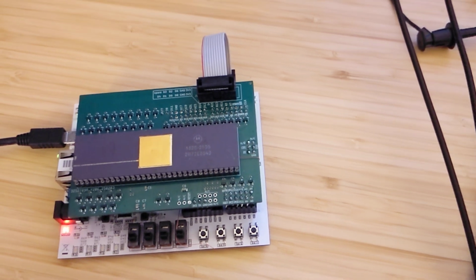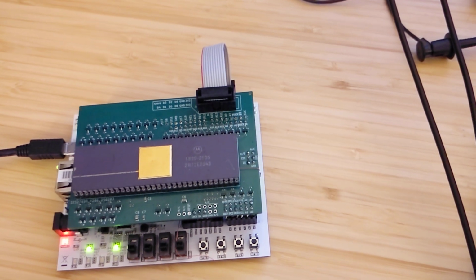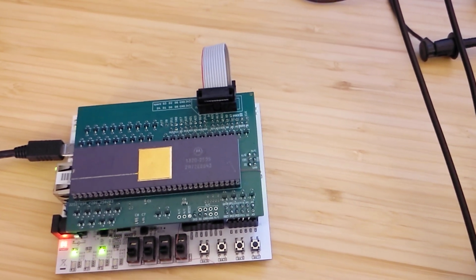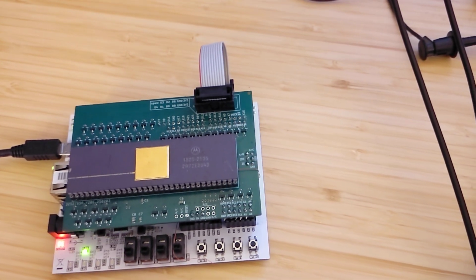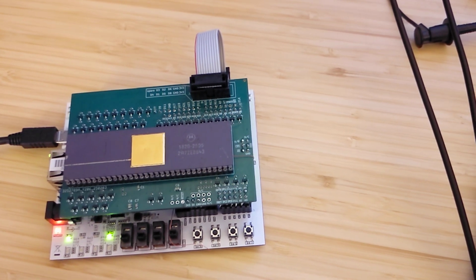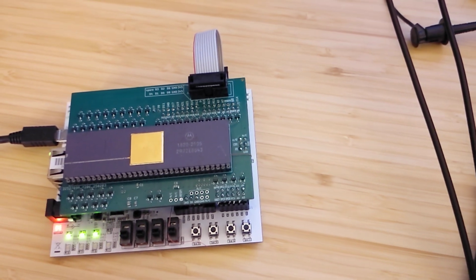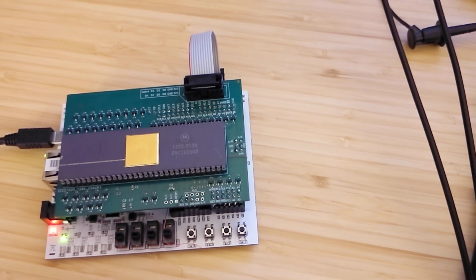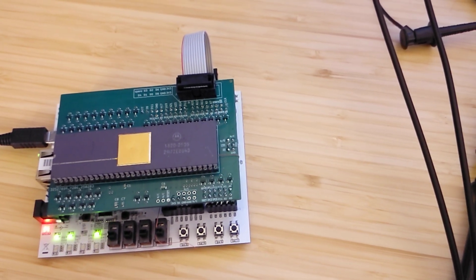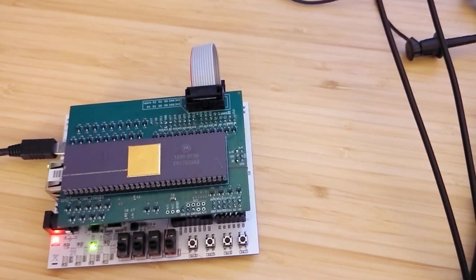And from the fact that the program would run partially, but then crash, I deduced that it must be an intermittent connection. And on the logic analyzer built into the FPGA, I was able to catch that data getting garbled, which then garbled data going into the processor as instructions just makes everything go off the rails real quick. But after reflowing that pad, it works perfectly.